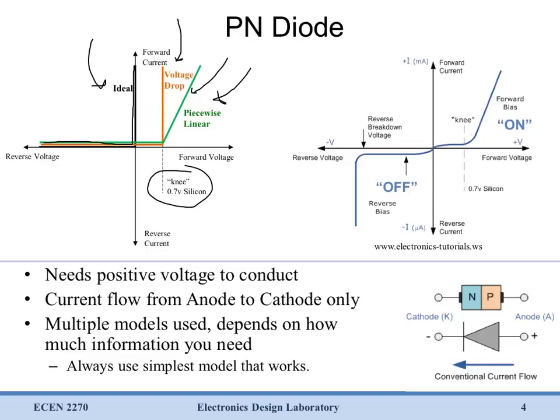All of these lines are just approximations for the actual diode operating line as we can see here. If we do have forward voltage we start conducting forward current. We have some knee voltage — it's 0.7 to 0.8 volts for a silicon diode — and we have what's actually an exponential line here with increasing current as we keep increasing the voltage. In addition we have a reverse region which most of our models ignore. We do block current for most of the reverse region, but eventually our diode is going to break down, and we see this increase in reverse current as our diode passes its breakdown voltage. Sometimes this is a destructive process; sometimes the diode can recover. But in general it's not a good place to operate your diode.